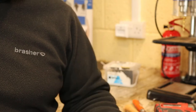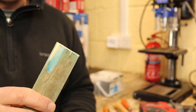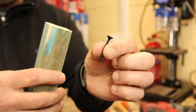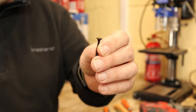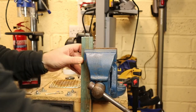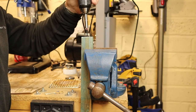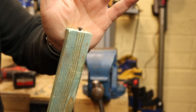Is there another way? Absolutely. I've come up with a method that's quick and easy and you don't need any specialist tools. All you need is a piece of wood — in this case a piece of roofing batten — and a drywall screw. This is a 35mm drywall screw; anything roughly the same size with a countersink on it will work just fine. Put your piece of wood in a vice if you have one, then take your screw and screw it into the top, leaving it protruding a little bit out of the top of the wood.